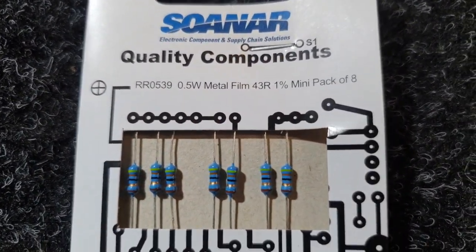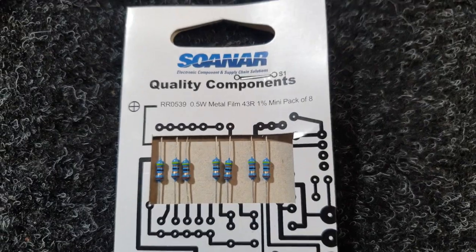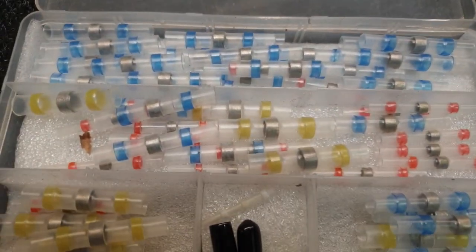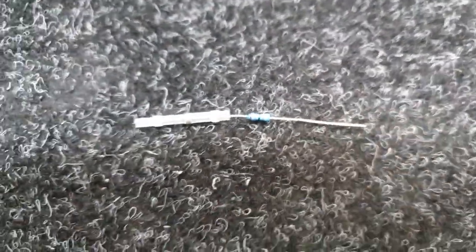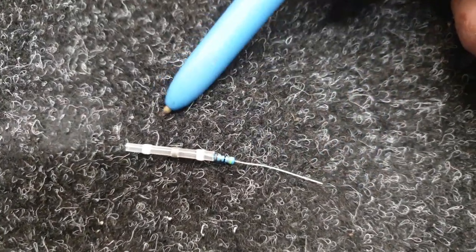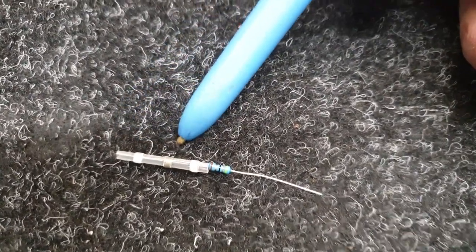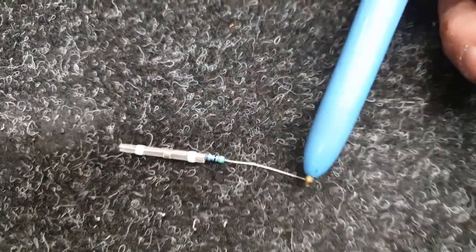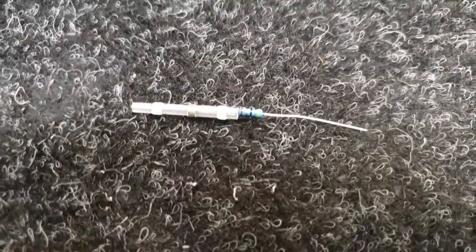I've got myself a 40 ohm resistor — 43 ohms was the closest I could get without going up to a 1 watt, so I'm sticking with the half watt since that definitely worked. I've got these little heat shrink solder joiners — the smallest one here will actually fit the resistor right in it. I'll cut the tail off the other side, slide it in, slide the black H2O sensor cable in, heat that up, put a bit of black heat shrink over the whole lot, and this end goes straight to the breakout box.